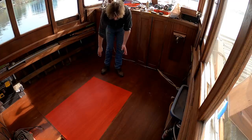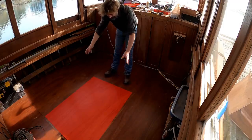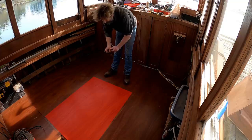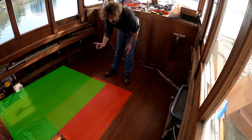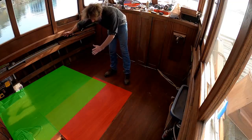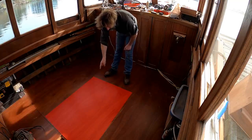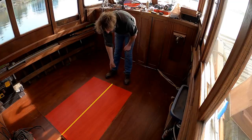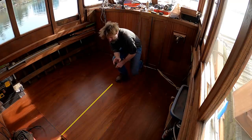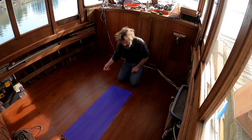And it's got a bulkhead at this point, as well as at the back and the two side cuts. So it's completely enclosed. So lifting this entire panel is access to the engine. Now, it's not that simple because there's going to be a dinette, there's going to be furniture over here. Now, this component of it is movable, but largely it will exist out to about here, almost halfway across. So I'll also cut this panel lengthwise and put a piano hinge in it so that for 99% of regular engine maintenance, you'll have a lift ring here and you just lift this section of the panel and you can access,